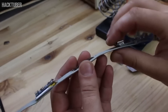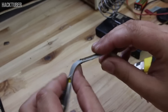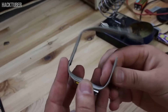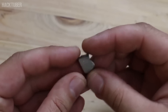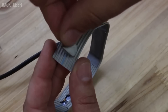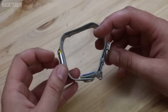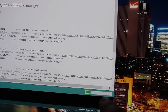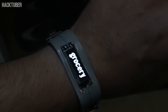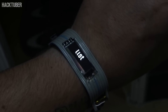To explain the circuit for powering this gadget: you need the battery and charger, from there it goes to the main switch which powers up the Arduino Nano and OLED screen. With two strong neodymium magnets we're gonna make the lock system for our wrist gadget. Hardware is finished — now you can upload the sketch code that you can download from the link below, and yes, you can change the text to your desire. You might wonder what the purpose of this is — for me it's like a task reminder, and every time you look at your hand you will know what to do.